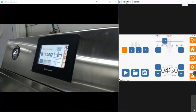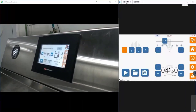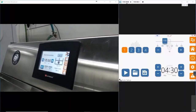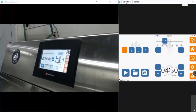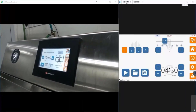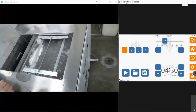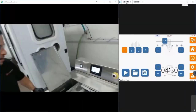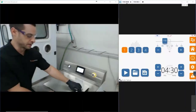I'll show you the feature of the SVC technology — so it's the submerge, meaning it's submerged from the detergent. A vortex — the fluid motion that moves around the part encompassing the entire geometry — and cavitation, utilizing our ultrasonics to clean that part as well. You can see that vortex motion start to work underneath the surface. We have jets that move the fluid in a circular pattern. You can probably hear the vibration of that ultrasonic energy as well.